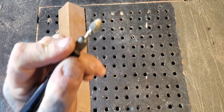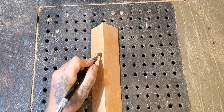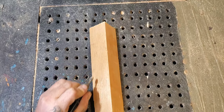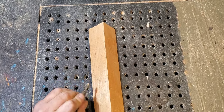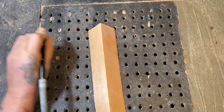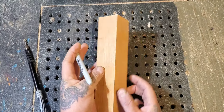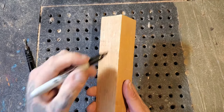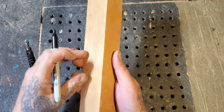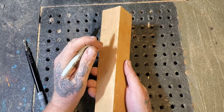For the real beginning carver, make sure the piece is comfortable in your hand — figure it out. Because when you're carving, this thing can bounce out. Just get used to carving real basic lines, nice and slow, not too fast, not too deep. This is my go-to formula to carve a wood spirit — every single time I use this formula. You can make the beards go with the wind, make them higher, longer, shorter — anything you want. But we're going to keep this one real basic.